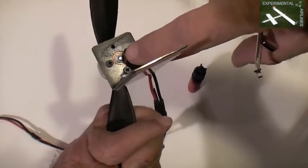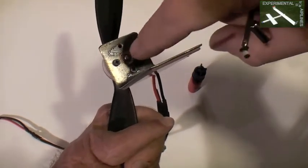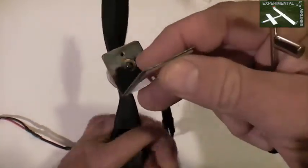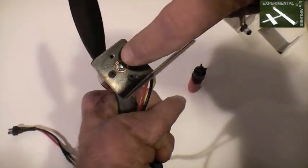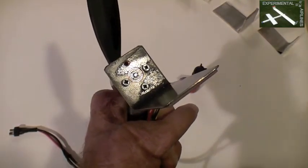Additionally, I like to drill out a slightly larger hole right over the bearing of the motor for cooling, for clearance, and also for lubrication if you decide to put a little oil in there. It also lets you inspect that the shaft is moving and that the clip holding the motor shaft in isn't binding against the inside of your motor mount or any debris that might get in there.